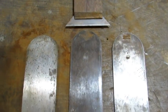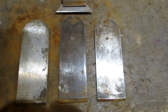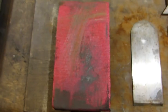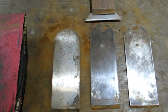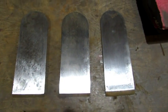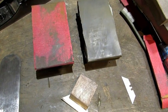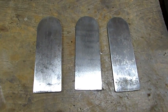A couple minutes work with my scraper revealed that the two irons on the right have patina I'm going to try to maintain. The one on the left is the sweetheart iron — it's in really nice shape, it looks almost new. So the next step is I'm going to use some 150 grit on my rubber sanding block to even out the patina and clean up that sweetheart iron. The irons cleaned up pretty good, from the youngest on the left to the oldest on the right. Tools used: 150 grit, 3000 grit, and first thing was a good scraping. Next thing to do to these irons is sharpen them.